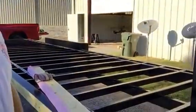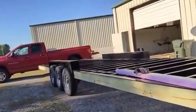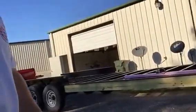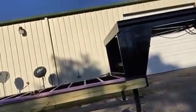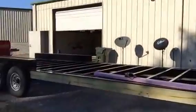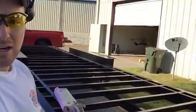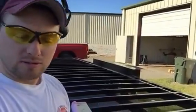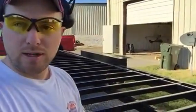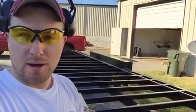So that's what I'm doing here — just going to put this last board on. You can see the other two sections where I've already done this and put them in place. I'm just finishing up today, this is my last little bit, and then I'll be taking it over to get the bottom side flashed tomorrow. That'll save me a whole bunch of time — the trailer guy is going to flash it, and then I'll be able to get my subfloor going, insulate it, put the ¾-inch plywood down, and I'll be ready for framing and putting the walls up. So excited about it.